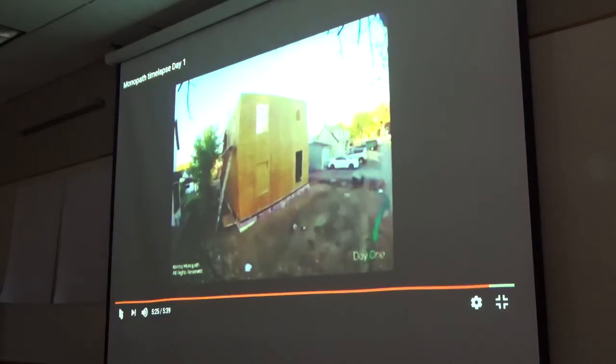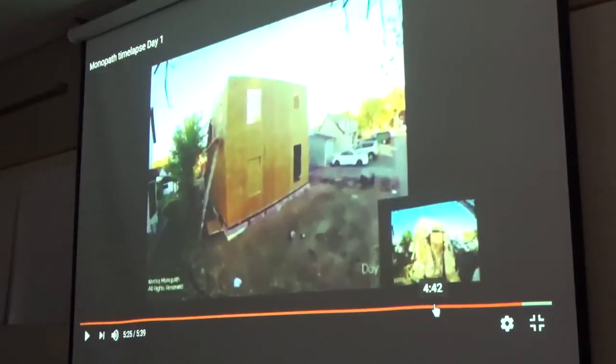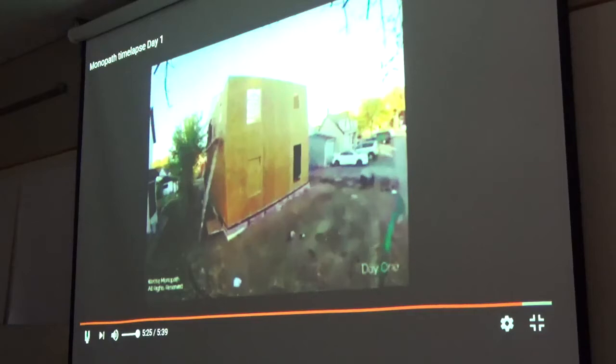Okay, so here we are setting trusses. Obviously, we want the crane to set the commons, and the rest of that can all be done by hand. But when the commons are set, then you want to bring up the plywood for the roof onto the 2nd floor and leave it up on the deck there, and bring up all of the mono trusses and jack rafters up there. There is a framing detail that is required for the hip rafters.